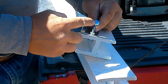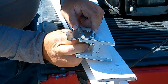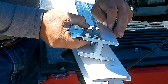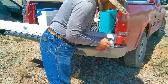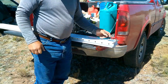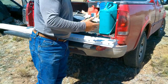Using a carriage bolt with a wide head and using the hinge as the washer, you really don't need any washers. Just tighten it up and it's good to go. Make sure you drill out your holes big enough that when you're slipping your bolt in, you can get it all the way in. You could use a shorter bolt, but the smaller things are, the harder they are to control and handle.